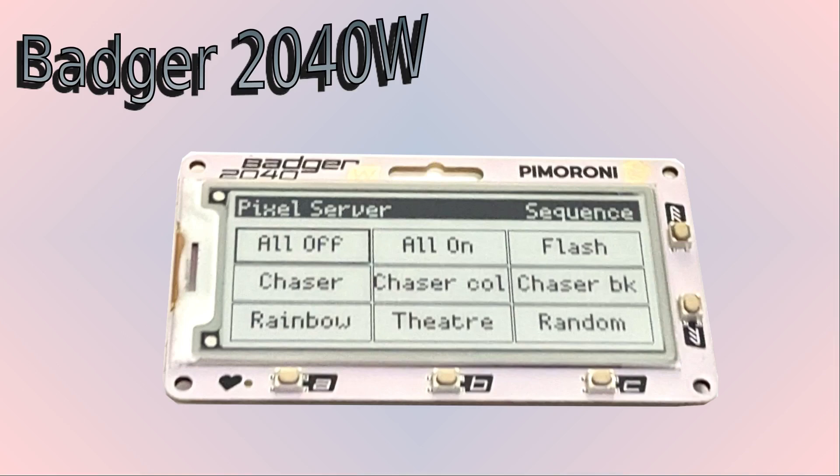I had a preview release, so I had to install the latest Badger OS myself — I expect that's installed by default for production versions. Even if not, it's just a quick download, then boot into the boot setup mode and drag and drop the file into the removable drive, the same as you would do on any other Pico, just using the Badger-specific image.